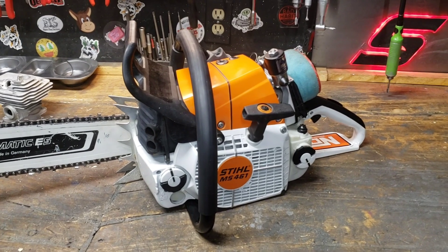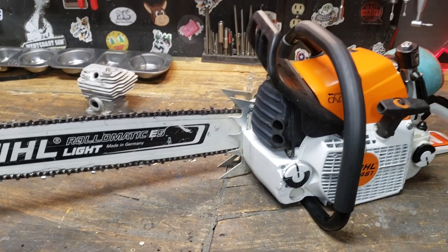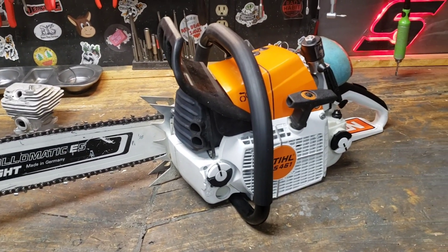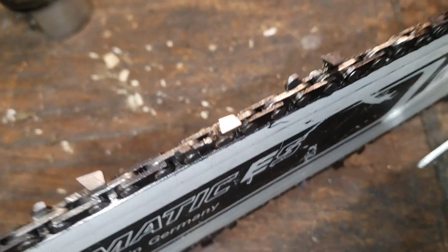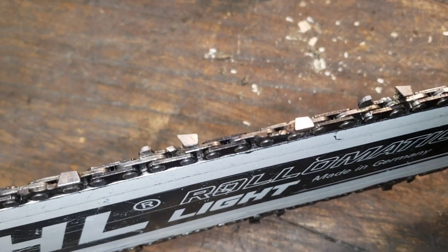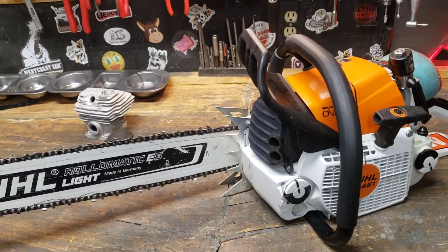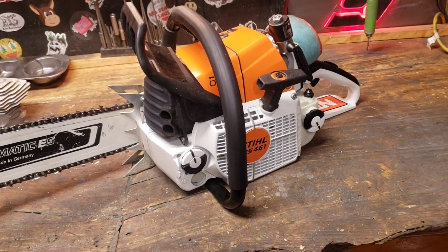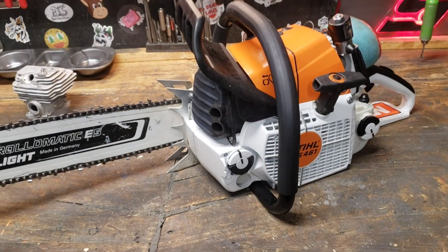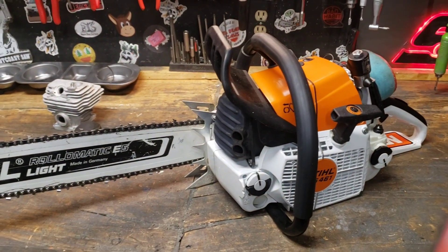This is why I tell people: try stuff for yourself. I wouldn't have thought that this would run as good as it did — I built it specifically for nitrous and it's actually a ripper. Check this out guys — this is with just a run-of-the-mill chain, bench ground with my cheap Harbor Freight grinder. The rakers are too low and it's got a rocked cutter — you'll hear it in the video, that stuttering. When you hear that while someone's cutting it's because they have a cutter that's chipped, what I call a rocked cutter. But this thing is like a beaver on bath salts, guys.